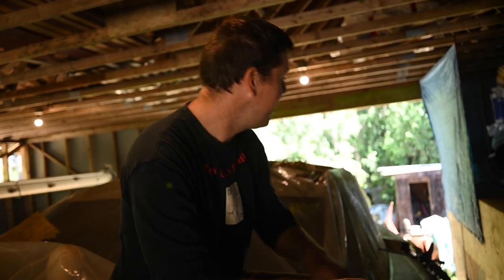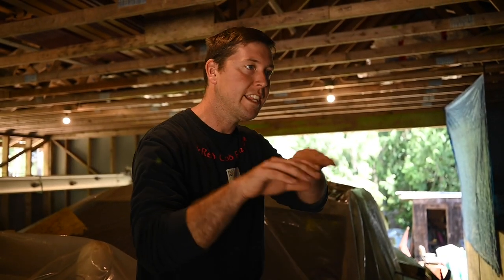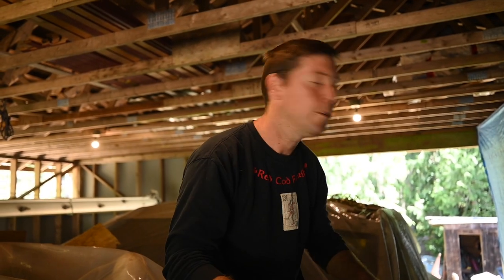The reason we're doing that is, I don't really know why. Because we felt like it. No. Because we're going to put a step at the back now. So if we had just the step at the back and left the rest of it, it would look a little bit odd, I think. I think it's going to look better if we have the shear come up a little bit at the bow and then have the step at the back to match, because they'll both be the same height difference. Right. That is the plan anyways. The reality may be different, but yeah.